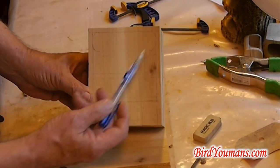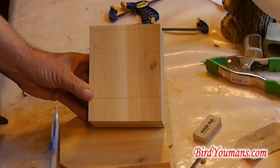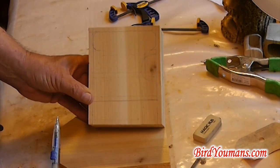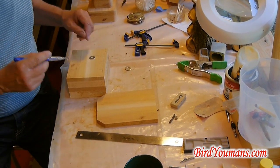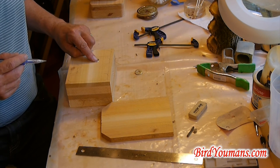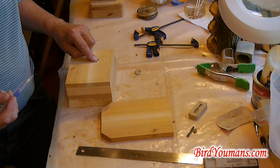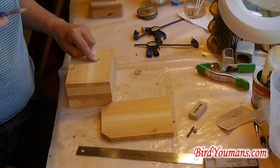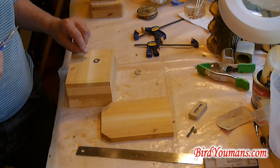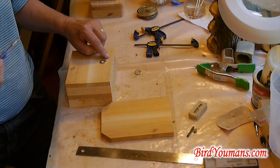I've already designed my drawers in here, but I'm going to leave this drawer a little short so that I don't take that knot out. Here's a little tip: depending on the width of the bandsaw blade you're using, you can only cut so tight a curve. I use a 3/16 inch blade, which is fairly narrow, so I can cut a tighter curve than this, but I just particularly like this — it has a nice little feel to it.